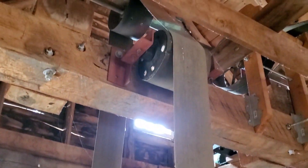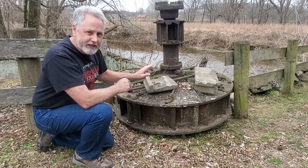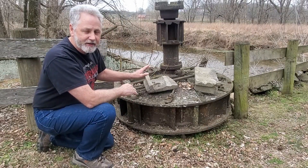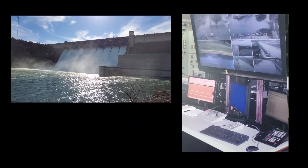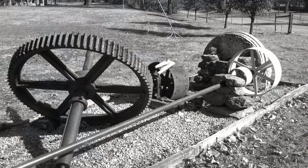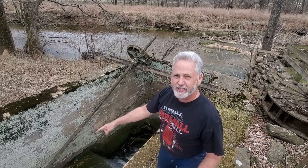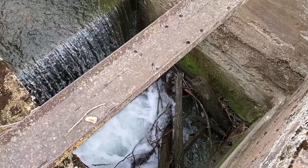This is by far the most efficient use of the water, and these turbines came around in the late 1800s and were used very widely through the 1900s. Modern hydroelectric dams today are using a turbine that looks very similar to this to generate electricity all across the United States — so 1800s technology is probably powering your home right now. The shaft is still here; this container, when fully full of water, is about 14–15 feet deep, which would have been a very efficient use of power for this mill.